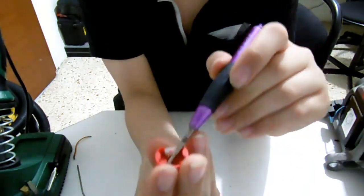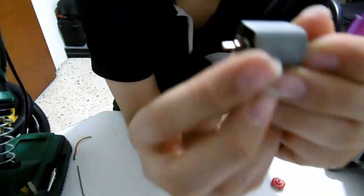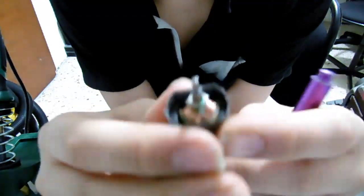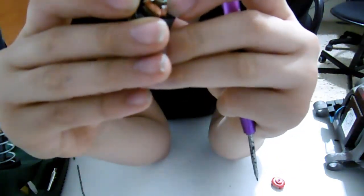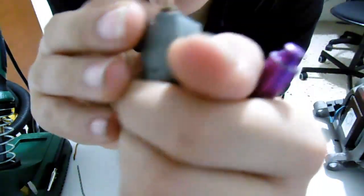These are the makeshift brushes. In this case, they are metal. This is the commutator, this brownish part. This big brown part here is the armature winding. You normally find armatures like these in small DC motors. In larger DC motors, you will have more than just 3 poles. And these two are the permanent magnets on the side.